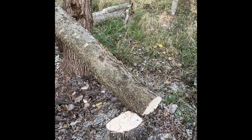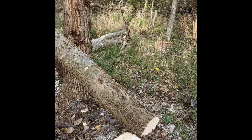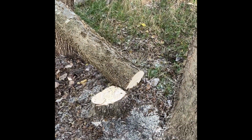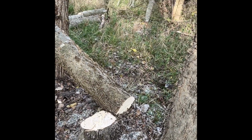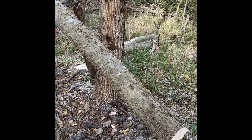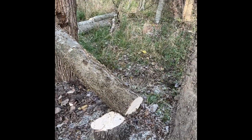See, there it is. It kicked back a few inches, not much, because it kind of rolled and then kicked back. So that's okay. I went behind it, carved out a little more, then went on the other side, carved a little more, and then came back to this side until it gradually just kicked off. And so now it's cut, right? But it's hanging there, so I'm not gonna leave it there because it's a risk to somebody on an ATV or a cow or myself. So you cannot leave a tree like that. You gotta make sure you completely take it down.